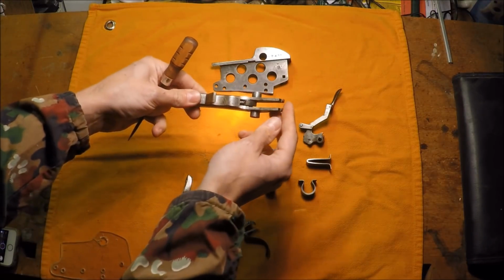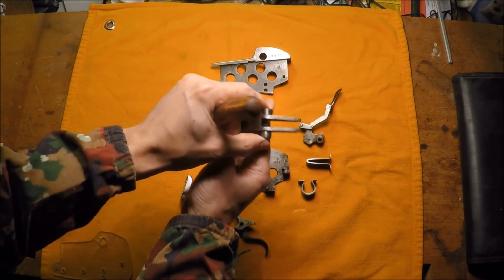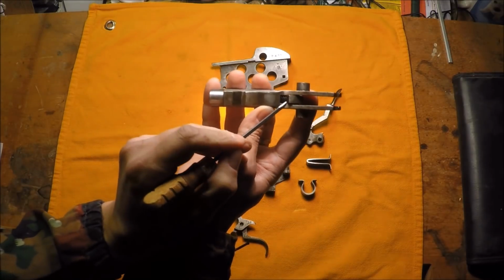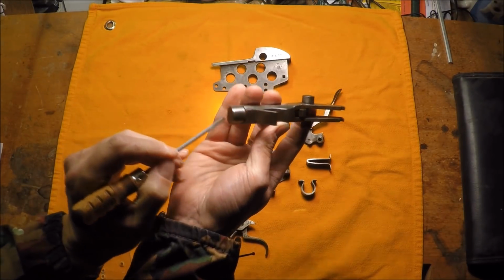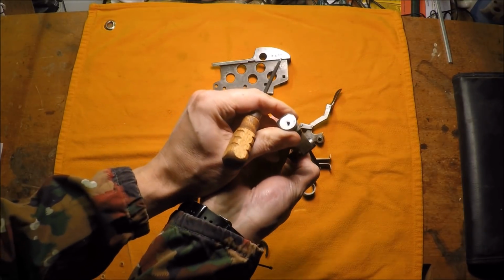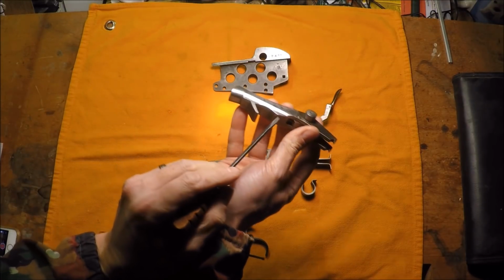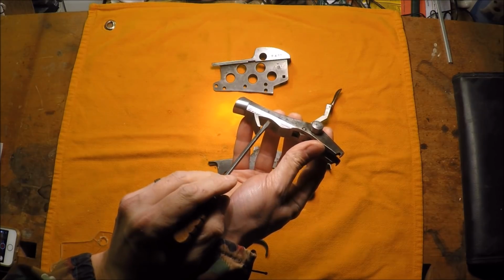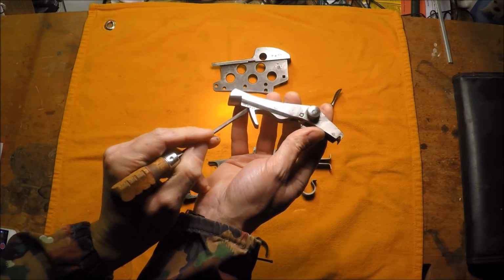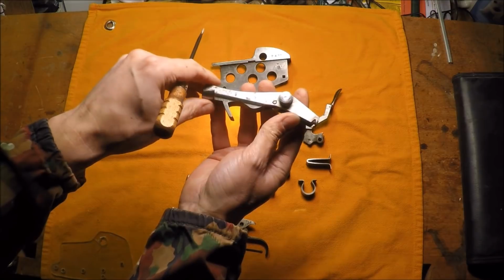Then we have the breech block. Again, quite a chunky piece of metal, chunky trunnions here. Inside we have the firing pin, which is spring biased there, and also very important to the system, this camming surface here and this breech block strut. Another two things to keep in mind for later.